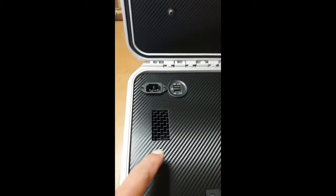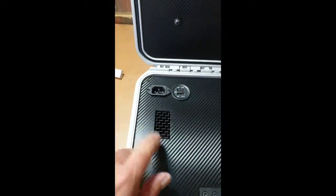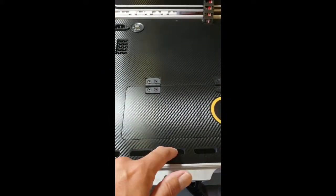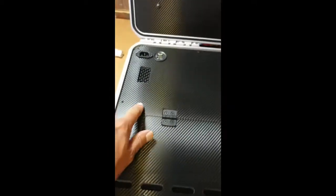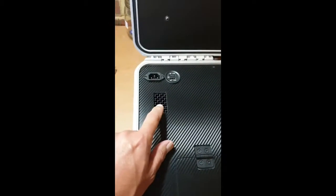So we've got the cooling fans again. I've gone for slightly bigger radial fans on this one. The reason being, because I've got the storage compartment at the front, I was not necessarily fearful as such, but I was more conscious to make sure we had a lot more cooling air flowing. So I've gone for the bigger, I think these are the 9030s radial fans.